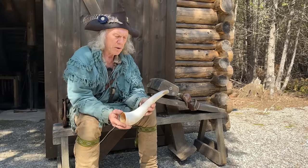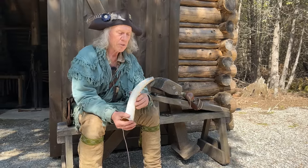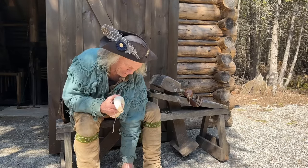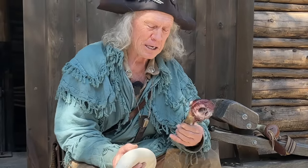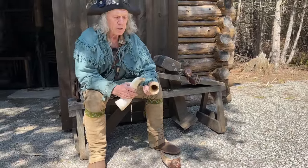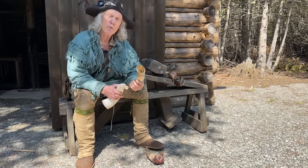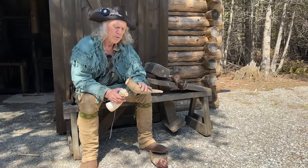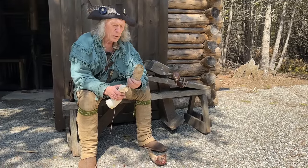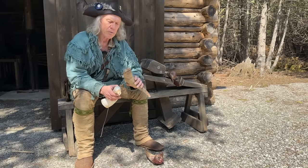In terms of constructing a powder horn, one could do it in a day. Essentially, short of putting a plug in and a cap, I've got a finished powder horn. Here's a fresh one — that's right off the cow. I've got a basket full of these. You can bury them in a manure pile; this material is not going to rot, and that's why it works good for a powder horn. It's made of keratin — it won't rot and it won't leak. You can boil them out, or just let them rot out, which takes the better part of a year. You can boil them out in a few hours.